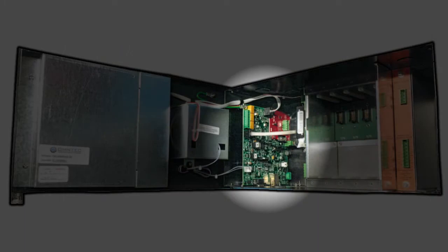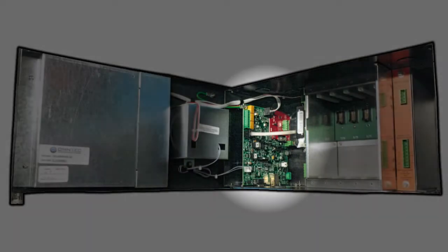A red RS-485 communication board is mounted on the MCU and comes standard on the Proteus X. On the back of the controller is mounted a back plane which will house the various interface boards, explained later in this presentation. The card cage will contain a metal barrier to separate the intrinsic and non-intrinsic boards. A total of 6 interface boards can be installed in the card cage, with a maximum of 4 boards of any one type.